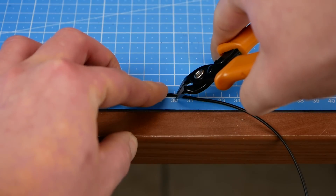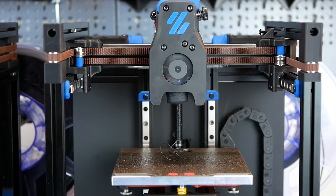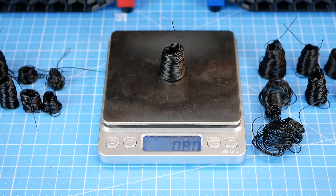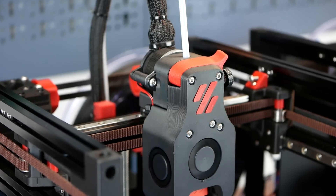The procedure is quite simple: weighing a filament sample of defined length as a reference in order to check the extrusion performance by increasing extrusion rates step by step. Weighing the extruded samples shows the amount of under-extrusion. As a result, you'll have an idea about the limits of your extrusion system, which will have direct impact on the theoretical printing speeds you are able to go.